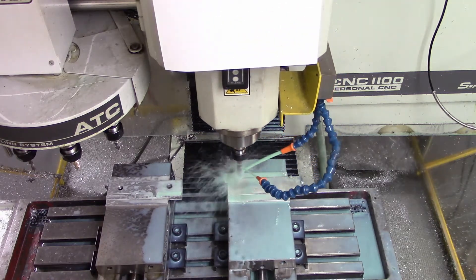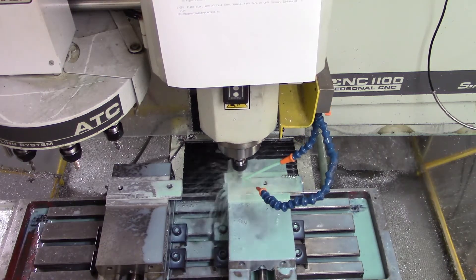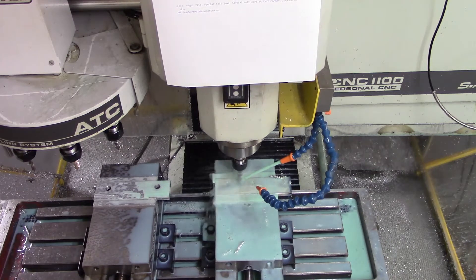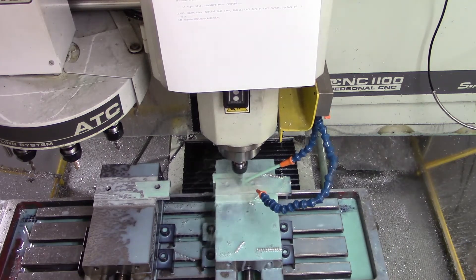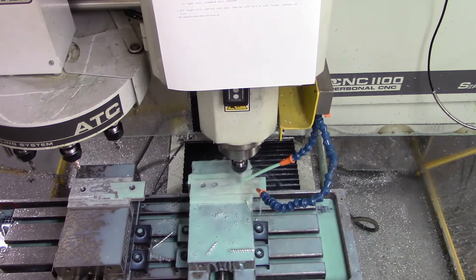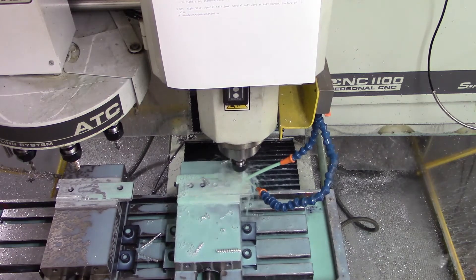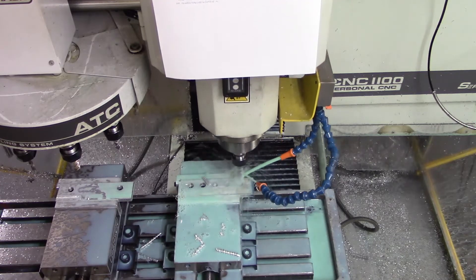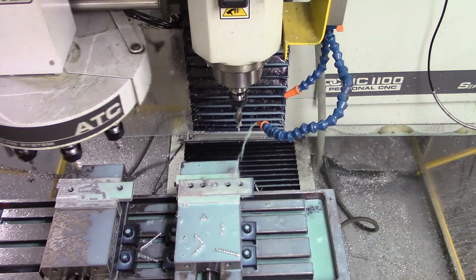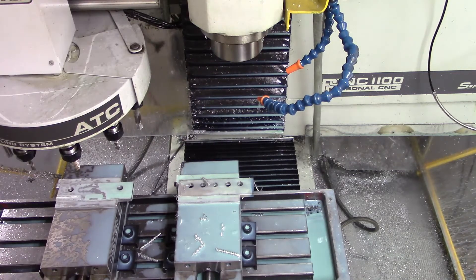Single step. Verify pre-feed height. Verify feed height. Drilling at 1500 RPM here. I actually changed my half-inch bit speed on the other part. This is producing very nice controlled chips. The slower speed and more aggressive feed produces a thicker chip as opposed to a longer, thinner, stringier chip. The thicker chips really do work better — the tool bit comes out completely clean. I may change that other program to the lower speed.